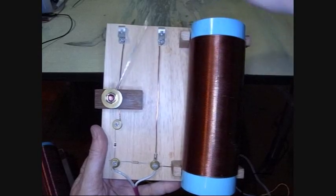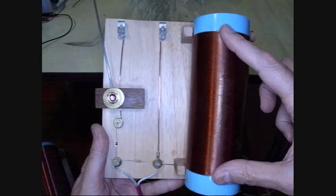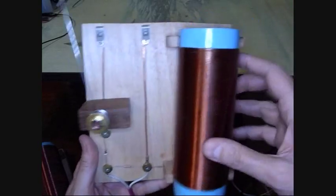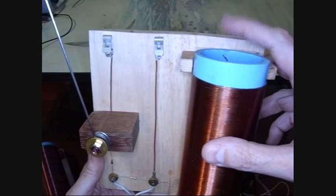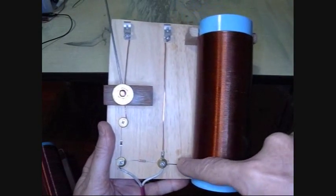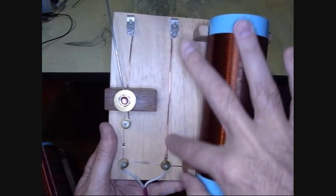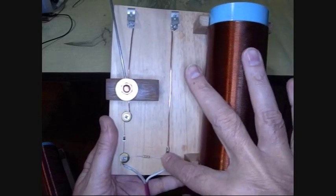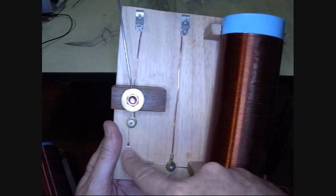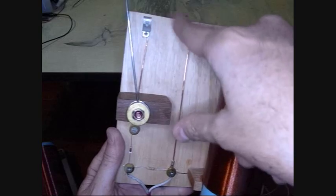This one is quite a bit different. Instead of being a U shape, it's a W shape. We have the right side of the W here, which is the coil — the coil has no connection up here at the top. It comes across and connects to the center of the W. The center of the W is the ground input. The ground input comes down here; earphone and resistor are similar across the bottom of the W. Here's the diode on the left side and it goes up and connects to the antenna.